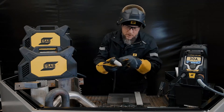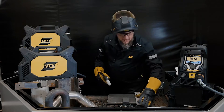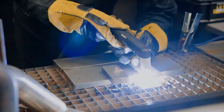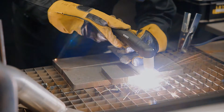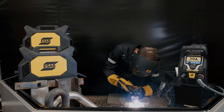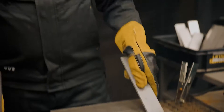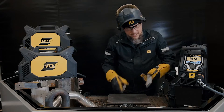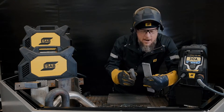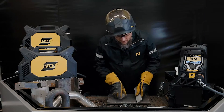As soon as I pull that trigger, I get a pilot arc. Good to go — 30 amps, solid metal. Let's see a cut. So that's some mild steel there — definitely some interesting mild steel. It's got a different sound to it, so I wonder what the composition of that is, but still a beautiful, clean cut.